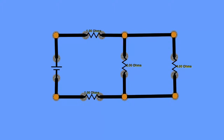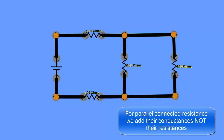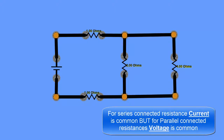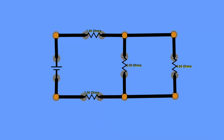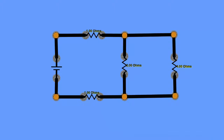For parallel connected resistors we need to find amps per volt, because the common quantity two parallel resistors share is voltage, not current. In series resistors, current is common and we simply add resistances. For parallel resistors we use conductance, which is the reciprocal of resistance. We use a unit called the mho — ohm spelled backwards — which is more intuitively obvious as the inverse of resistance. There's also the siemen, but mho is preferred here.